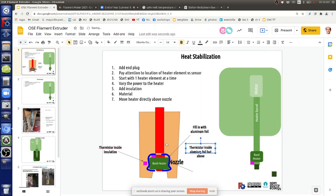Yeah. Is it easy? No. Yeah, I mean, the simulations would be awesome, except we don't have a couple of PhDs available for a month of time. I think here we have a really clear roadmap on how to eliminate all the impossible possibilities and troubleshoot one thing at a time. So I think this is a good approach. And then if the flow is not good enough, then changing the auger speed is possible, changing the nozzle width is possible.